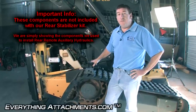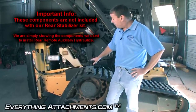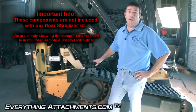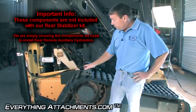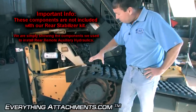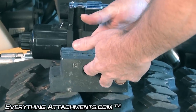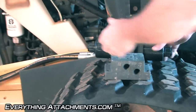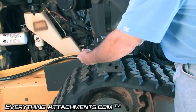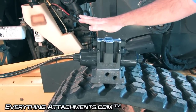We're going to start by giving you the base components that are used in the hydraulic hookups of these rear stabilizers. They may also be used on a tractor for auxiliary hydraulics. You have your cast iron base plate, which you're going to bolt down to your machine. Your hydraulic connections are down here in your base plate. So when you get ready to fit this to your machine, you're also going to have this hydraulic solenoid valve, which is what decides which direction the fluid goes mounted there.